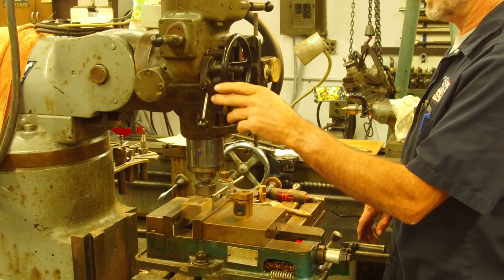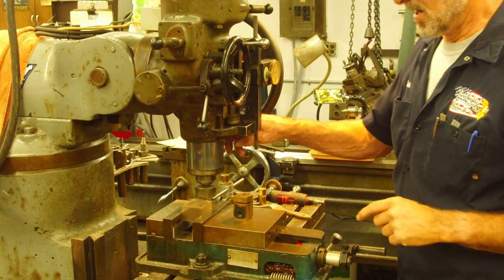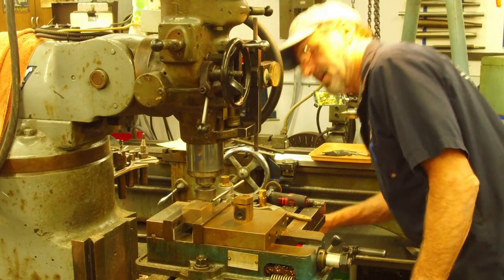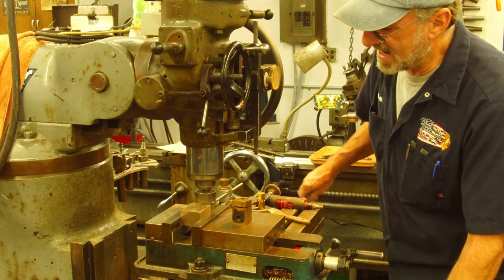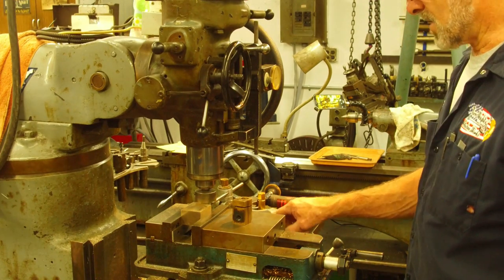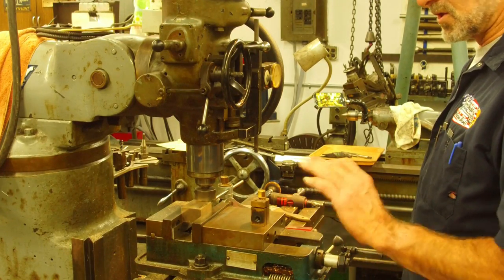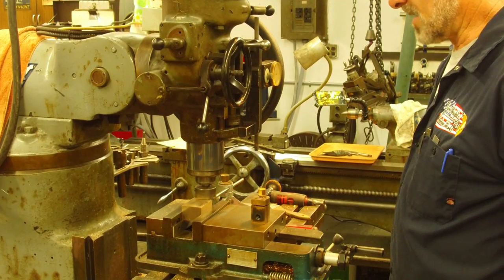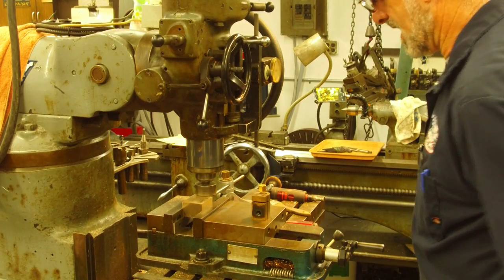We're going to go ahead and give this about 10 from there. We do know that we scratched across the top of there, and it's pretty close to the diameter of our cutter. We're going to come across. Hopefully we're just giving it a good surface finish first time across, and then we can flip it over and we can work the width on the other side.